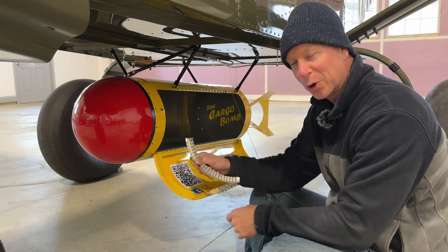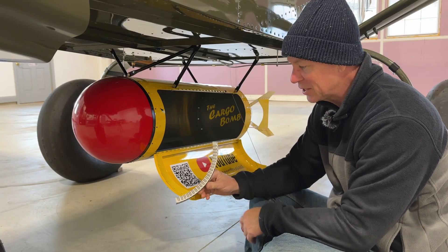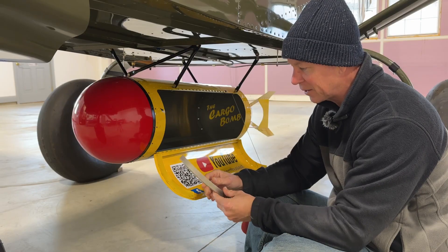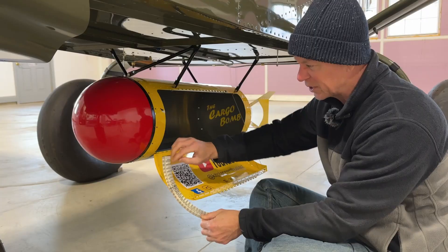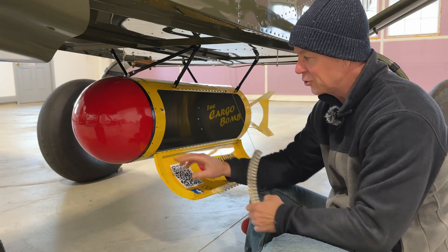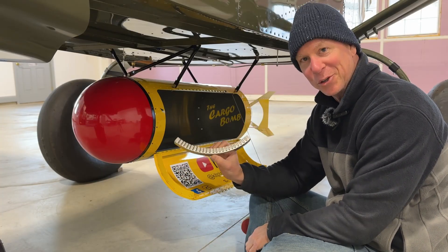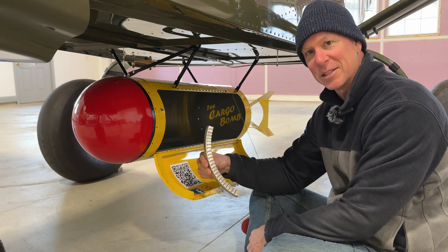The problem is you can see how many flutes I have in here — I have as many as I could fit and also as deep as I could make them — and I still couldn't get this to curve to the same curve as the door. It's just a bigger diameter, so this did not work. The method I used ended up being my backup plan. I forgot to show you the whole reason I did this was because this just didn't work as I originally wanted.